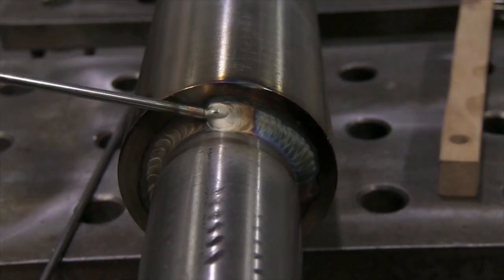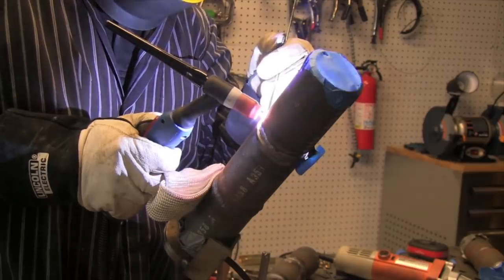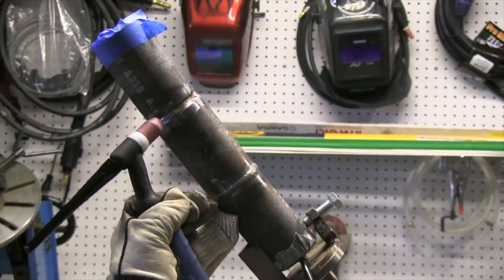One of the best reasons for a TIG FINGER is if you have to take a 6G welding test. I'm doing a little keyhole dip method here on two-inch schedule 80 6G pipe. The last thing you want to worry about when you're stressed out over passing the test is your knuckles burning because you hung in there too long, because you really need the job. Propping with a TIG FINGER kind of eliminates that. I'm going to come over that root pass with what's called a hot pass - it's not always hotter, but in some cases it's 10, 20, or 25 amps hotter than the root pass.